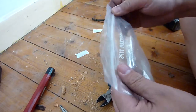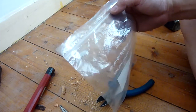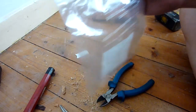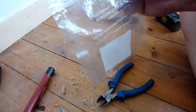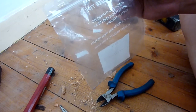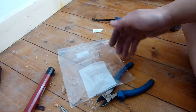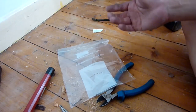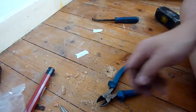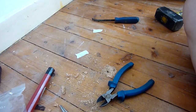So this is the least destructive way. If I went in from below, what I find is, I'm not a plasterer, and it'll be a mess, and it may not help me to locate where there are breaks in the cable, because originally the house would have been built, the ceiling would have been there, then the cable's laid, then the floorboards on top. So if I dismantle it the reverse of how it was put in, that would be the best, least destructive way. So I'll run you through it.